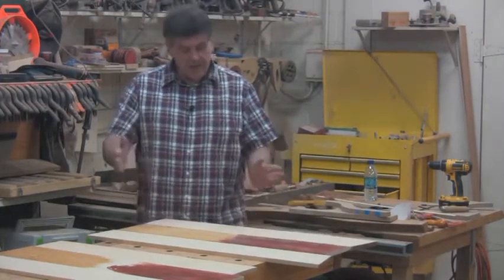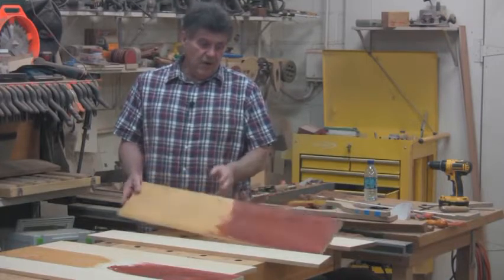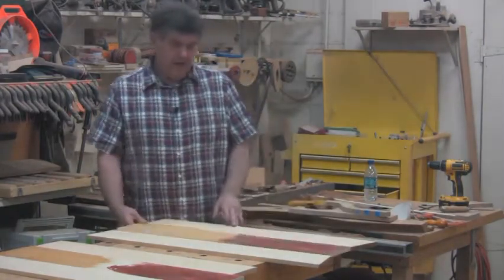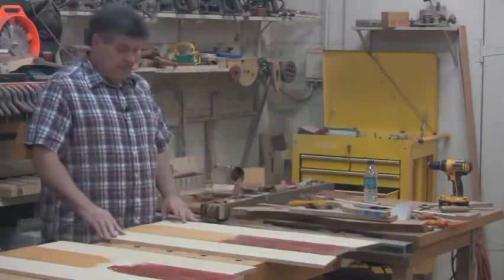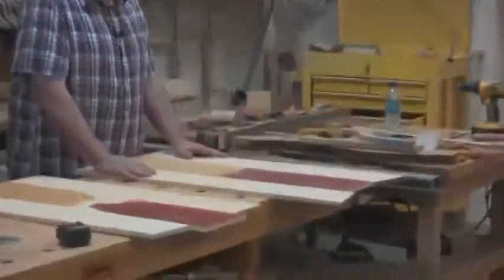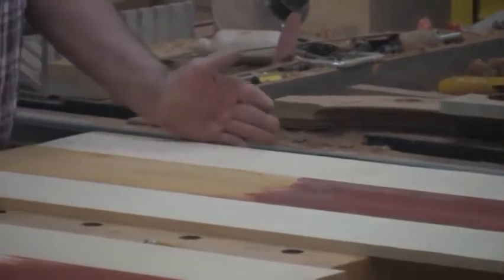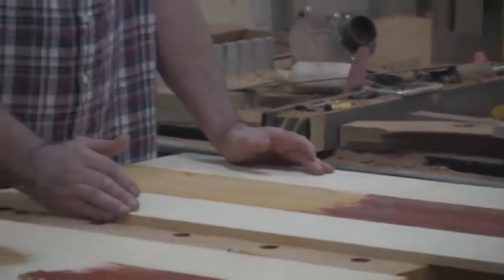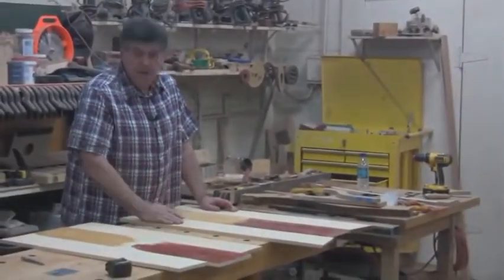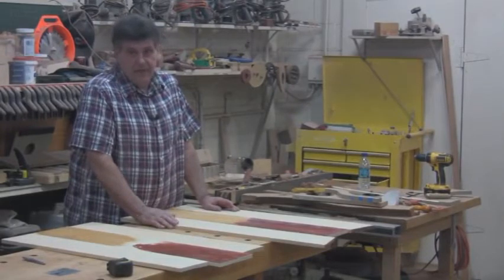that we just did. Now, I cut them down a little narrow because this was a little wider and it was clean, as you can well see. So then what I did, I want to be about 18 or so. So what I've got, this is 20 inches. Another thing with pine, either use a caul on the edge when you clamp it, or in this case, I'm just wide enough that I'll be able to come back and trim it off, because a clamp will definitely leave a mark on this pine. It is soft.